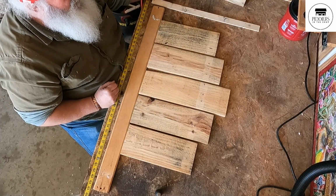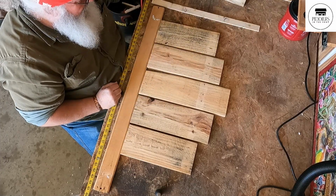And that's so the wood on the fence can expand when it gets rained on a lot. If you put them up real tight, have you seen boards like that when they get wet, when they get rained on, and they kind of turn a little bit, especially right where they meet? So you want to give them a little room. When you build a fence or whatever, you give it a little space like that for that reason.